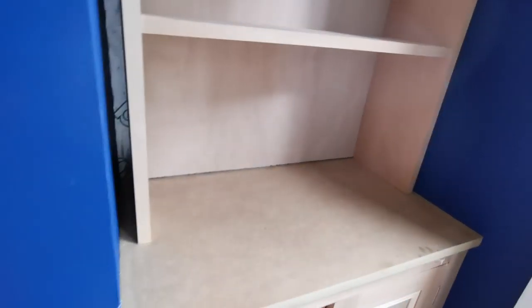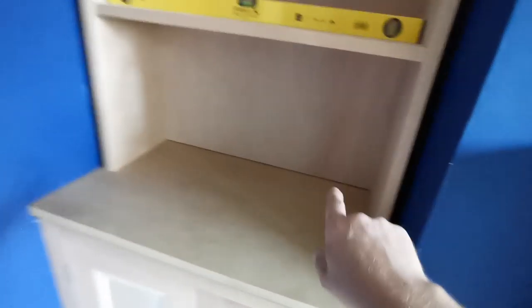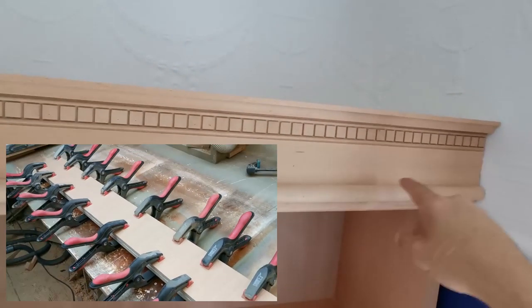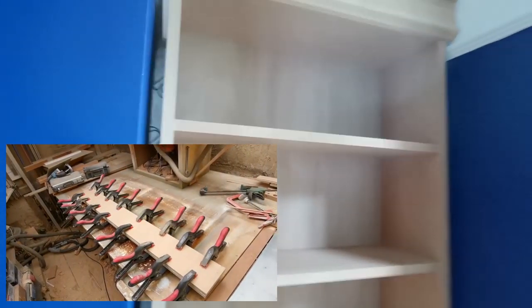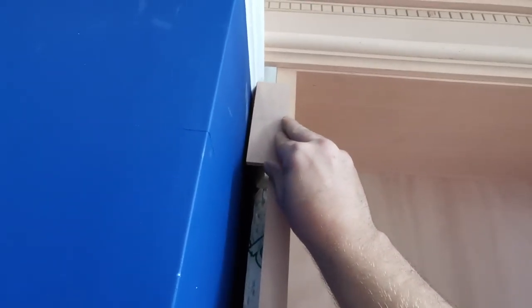I've cut a bit off the bottom, left it a little bit longer than it needs to be just so I can clean it up on my chop saw. I cut them with a rip saw and it's not cutting square, but I'll trim them a little bit when I get them back home. Just put the cornices on, because I don't want to be cutting those when they're painted. I've glued together some ply so I'm going to make some 45-degree braces on the back and side here. There'll be some trim pieces that'll screw to the wall, and these will get screwed up from underneath — probably need a batten along the back here.